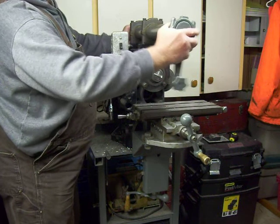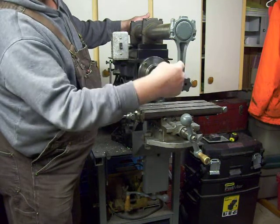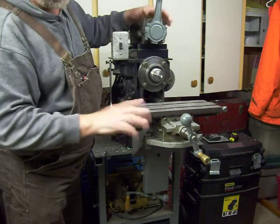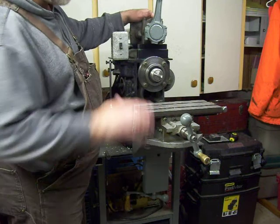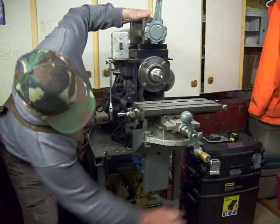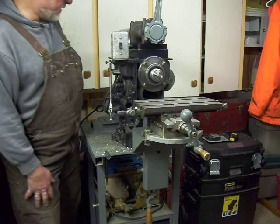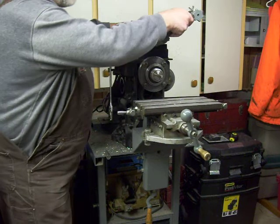This is the overarm support. When you put your milling cutter shaft in here, it's just a connecting rod that I use for an overarm support. The milling table itself is just a Chinese-made small cross slide table that came from Busy Bee Tools in Canada. For my vertical movement, I've got a part off of an old shaper — a clapper compound off of a large shaping machine. I put a stand on it, and it's got an old washing machine motor on it. That's really all there is to it.